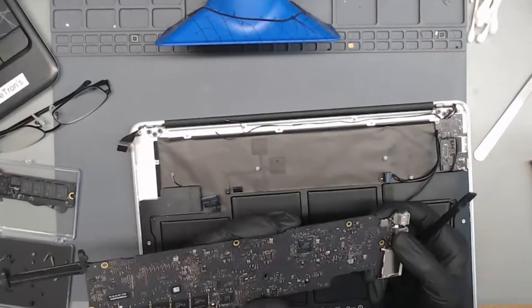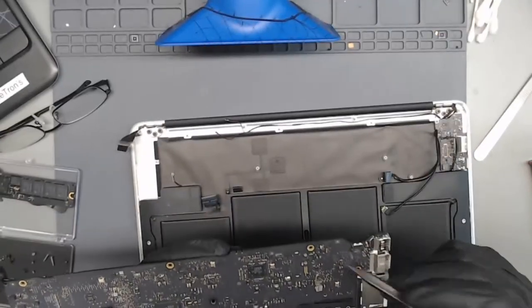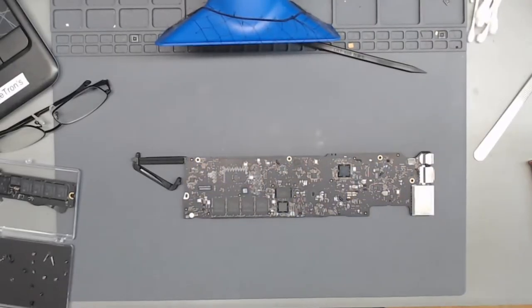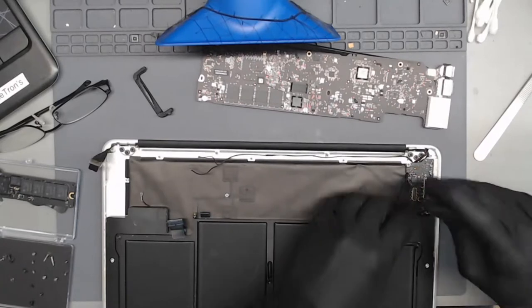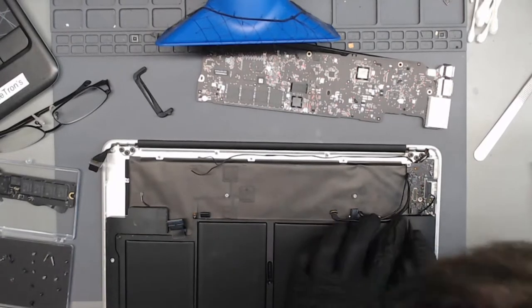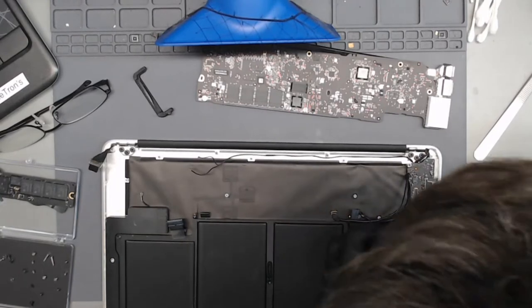That is the shiniest underfill I've seen around the SMC. This part of the board looks okay, except for maybe a little bit of corrosion on the backlight circuit. So let's set our computer to the side so we can continue. And actually, just to be safe, I usually use a donor I/O board. However, with the amount of rust that's in here, I want to check their actual I/O board out on the bottom side just to make sure there's no signs of rust.